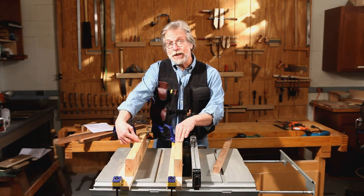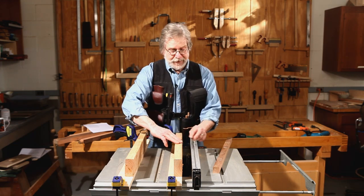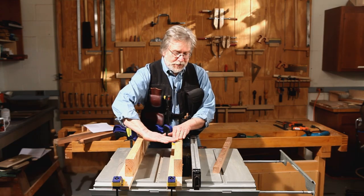I'm going to be putting the baluster through perpendicular to the blade, and we're using the fence as a depth stop. As the baluster comes across, the distance from the fence to the dado head equals the length of the tenon, and the height of the dado head is what you adjust to control the diameter of the tenon.